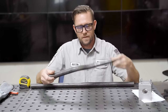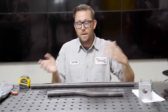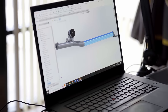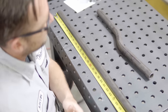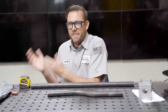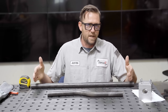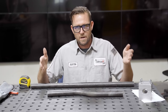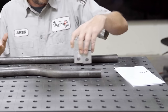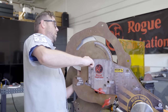Time to start some bending. This piece is a test tube, if you will. I made sure that my mark-out and measurements were good — they came from my drawing, which told me exactly where the bends need to be, certain lengths, and what degree of each bend. I pulled that information directly off the drawing — super simple, and that's why we use CAD. I know the full length of my tube. I did over-cut it just a little bit to have room to trim and fit up and make slight adjustments. The bender of choice: Rogue Fabrication Model 600 — the same bender I kept when I sold the JD Squared.